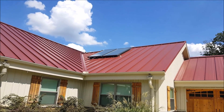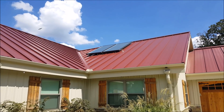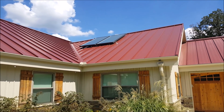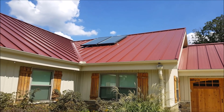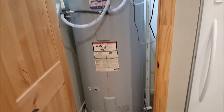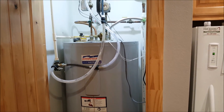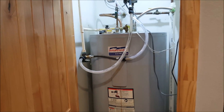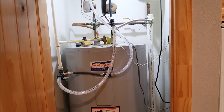The installation turned out to be quite a little deal. The panels have been installed at a slight downward angle so the water comes in at the very top, flows down through one panel, back up to the other, and then down and out through some piping in my attic, and down to the tank inside a closet in our laundry room. We originally thought about putting the tank in the garage but it would have taken up way too much space, so this ended up being a coat closet opening to the hallway that we changed at the last minute into our hot water tank closet.